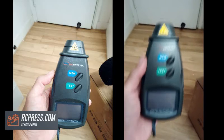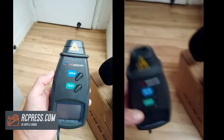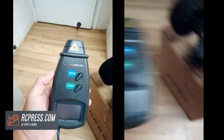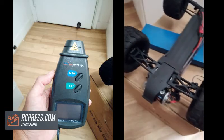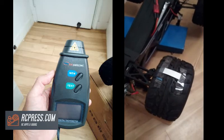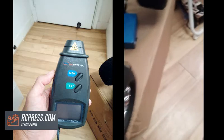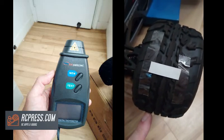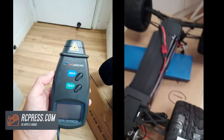The test button is for generating a laser beam to the reflective label on the rotating element. The reflective label must be secured on the wheel for proper measurement to take place. By pointing the laser beam to the wheel, you can find out the RPM under a no-load condition. The memory button can then be used to reveal the RPM data recorded.